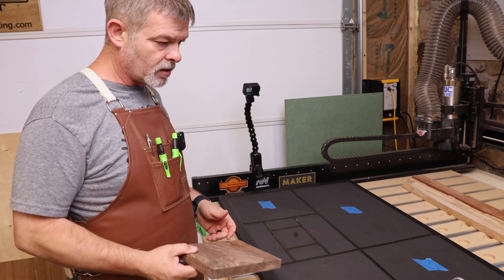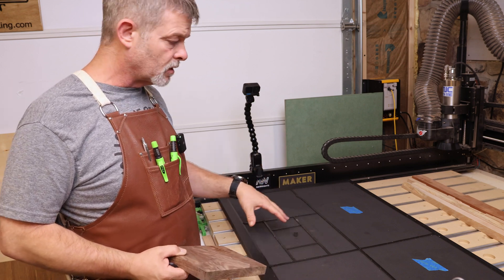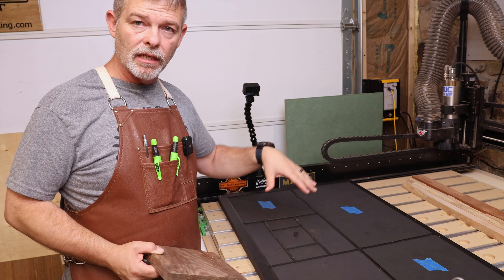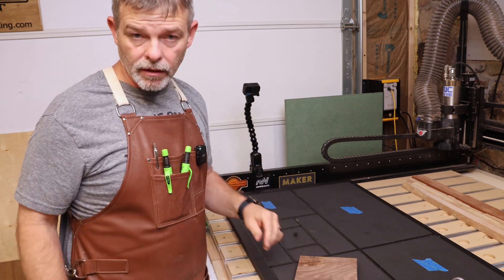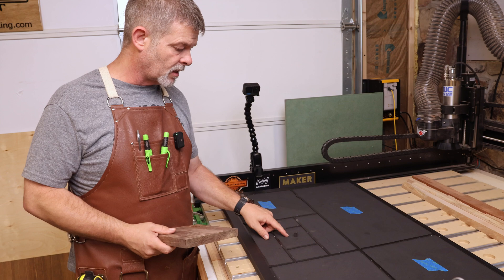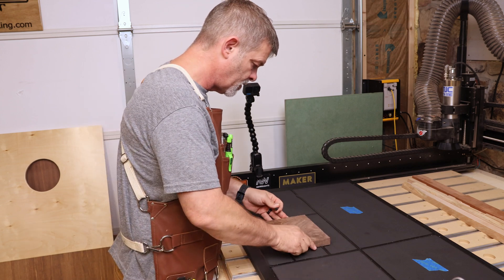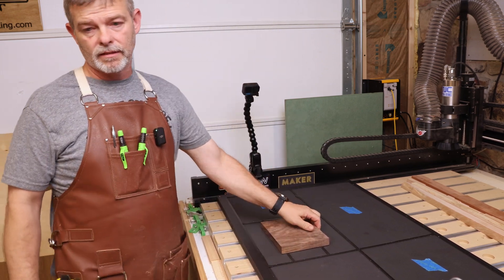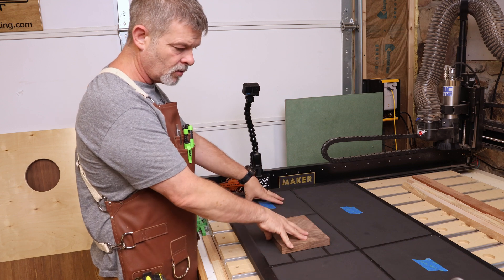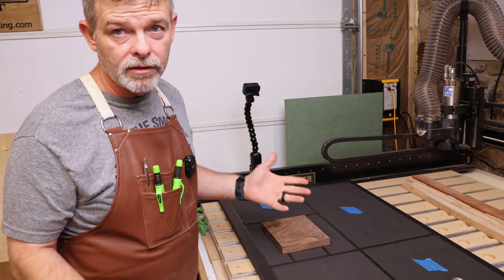Let's pay attention to this — just an example. Several different things you can do with this non-porous sheet: you can make different little areas. You do have to drill holes in this if you want to use it this way, but you can pocket out certain areas or grid patterns to get this set up for repetitive things. I'm going to turn this thing on. You can hear the vacuum change once it's pulling a good suction. I don't even have to look at the gauge — you're going to hear it. When I pull one of the little plugs out, you'll hear the air and suction. That thing is not coming off. I've got mine set up with an indexing reference so I can throw something on that covers the holes — there are tons of ways you can use this thing.